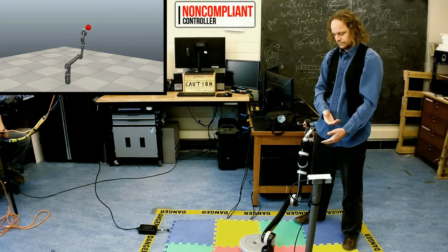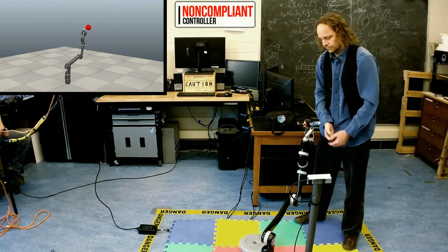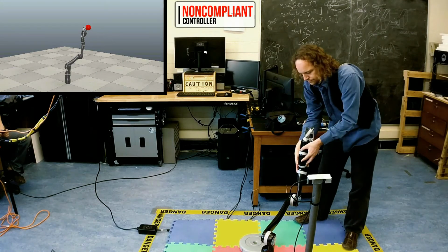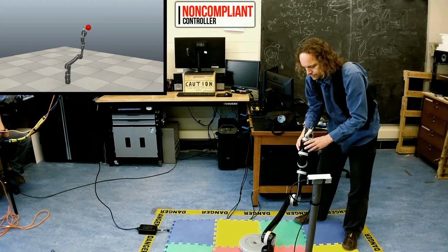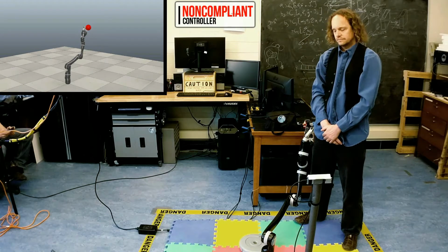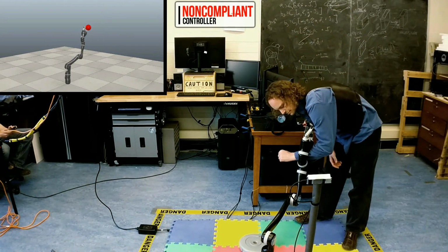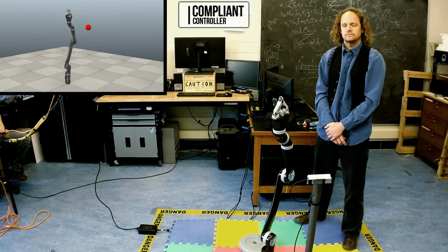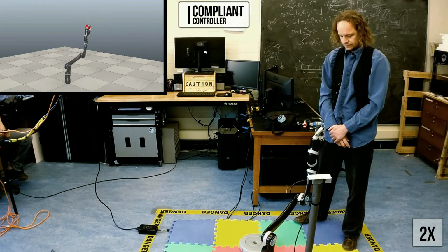This kind of control is position-based, meaning that the controller drives the arm to a specified set of joint angles. The controller will apply as much force as needed to move each motor to the target angle. This is accurate and repeatable. However, it's unsafe because the controller will try to push the arm through any obstacles, such as a table or person, along the way. Safer control methods have been developed which use force control instead of position control.